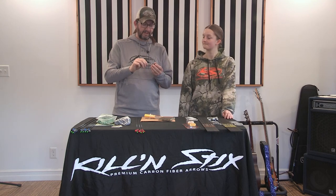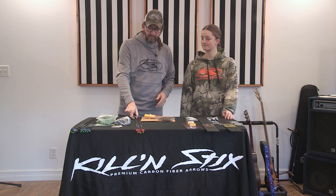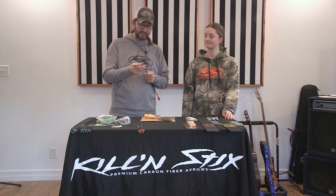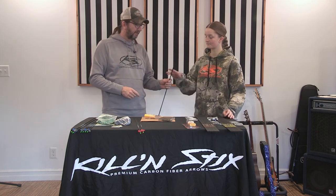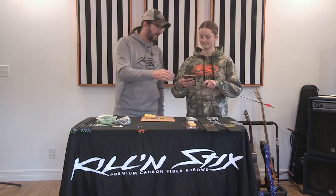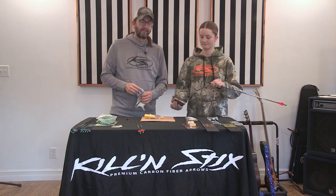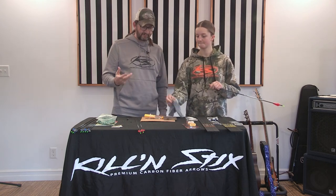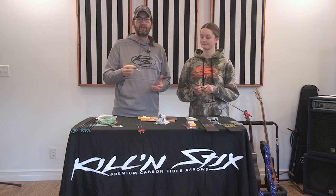You take this post and screw it in there, make sure it's tight. You always dry fit it like this — dry fitting means don't put any glue on. Slide it in there, make sure it fits tight, then pull it off. Now what we're going to do — I'll get Sophia to do it — is sand the end of that shaft, just that one inch it's going on. Fold it over and sand it. It doesn't have to be too much. Wipe it off, and that gives it just a little bit of friction or roughness to stick to. With the post, you're definitely going to have a lot of glue in there.